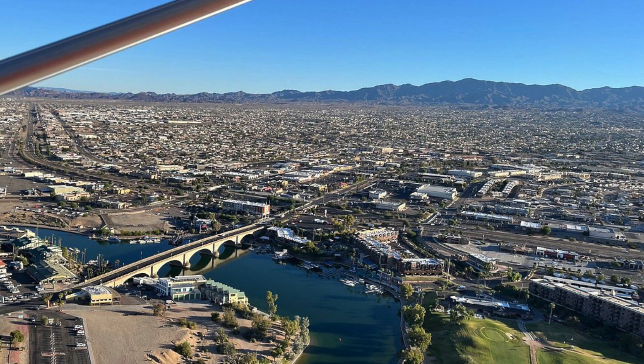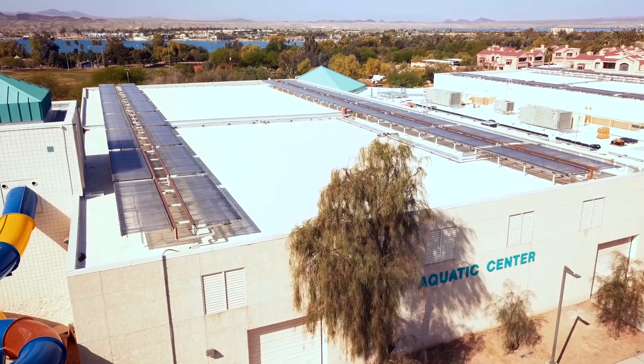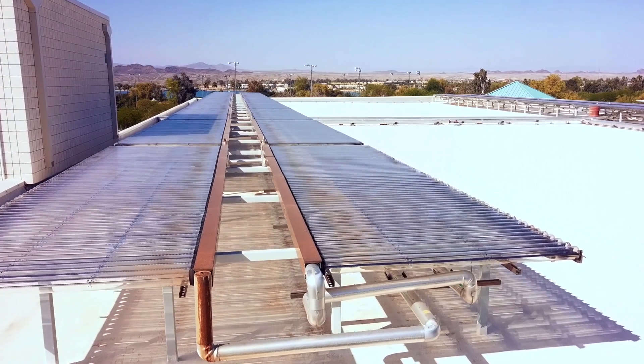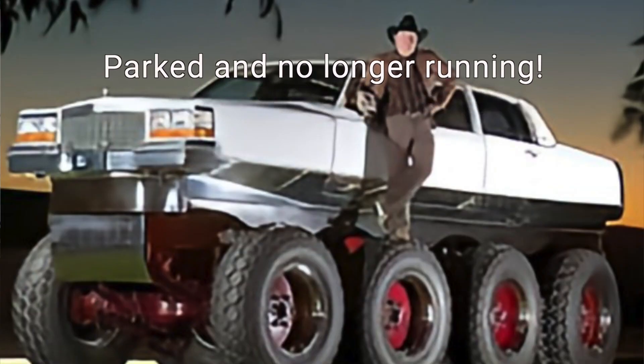Why is this so important? Well, mismatching collectors to a solar heating application can result in operational errors and a lot of unnecessary expenses. A prime example is the Lake Havasu City Aquatic Center, situated in one of the hottest places on earth in the Mojave Desert. It's puzzling why evacuated tube collectors were chosen in a hot climate for low-temperature pool and medium-temperature hot water heating. Perhaps for the same reasons, the collectors were installed flat, in spite of requiring a minimum 15-degree pitch. The engineers who designed the system lacked the necessary knowledge and expertise in solar technology and may have followed the guidance of a sales agent. I would classify this completed project as a Cadillac with monster tires — a luxurious ride for more than what you need, with a steep price tag for this road.